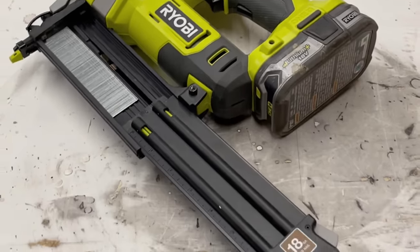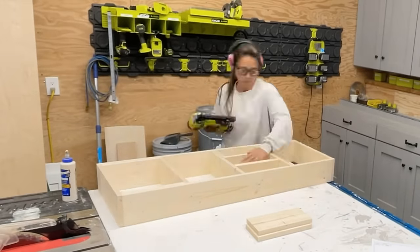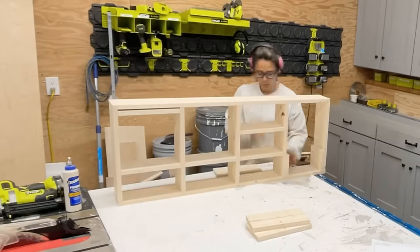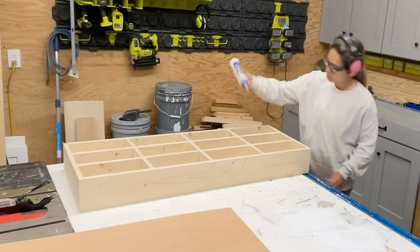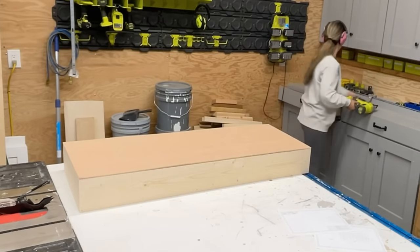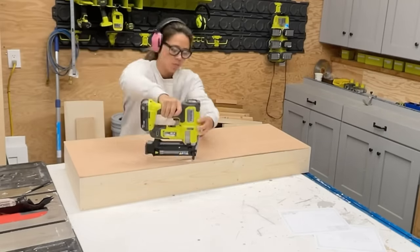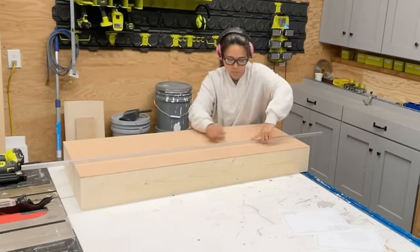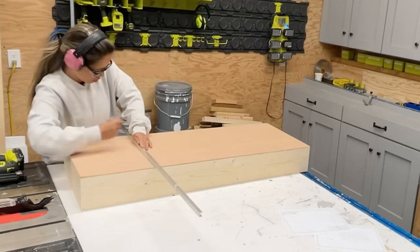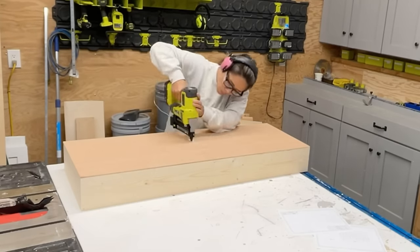Since this is a non-structural project — meaning nobody's going to be sitting or standing on it — I'm just going to nail it together. I'm using 1¼-inch brad nails and wood glue. The nailer is also handy for those intersecting joints where you have to nail at an angle. I'll need a brad nailer anyways for nailing the back on. I just cut the back down to size with the table saw, added glue to the back of the entire project, and then put the panel on. I marked with a pencil the location of all the center shelves and dividers so I can transfer those markings and use a straight edge to nail off to all the shelves and dividers.